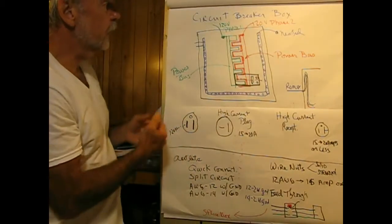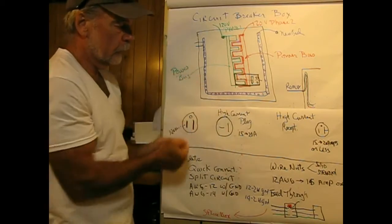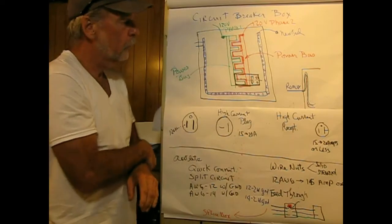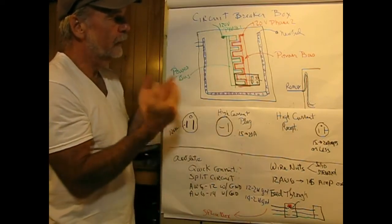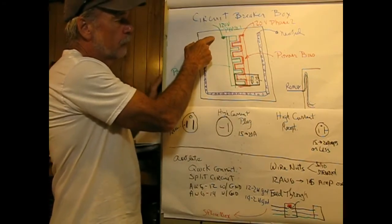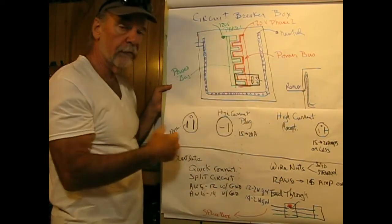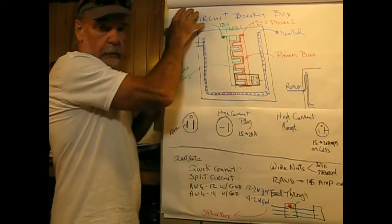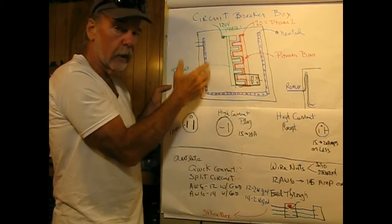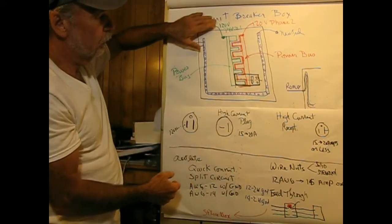Once the power gets into our house, and you have to excuse this drawing, there's PDF files which have this in the course directory, but I need to make this point: in the days of yester, when I lived in Manor, the breaker panel had to be within 5 feet of the meter. If it isn't, you have to install a main breaker right underneath the meter panel to feed your breaker box. So we have these two voltages coming in.